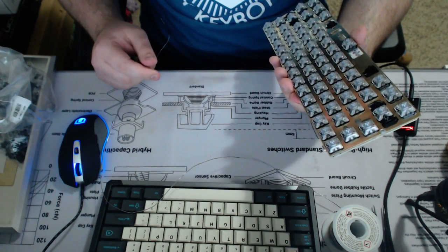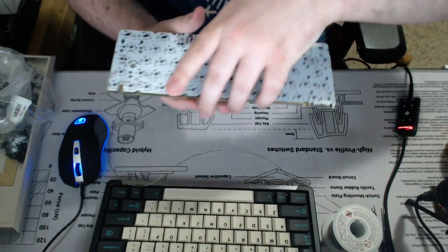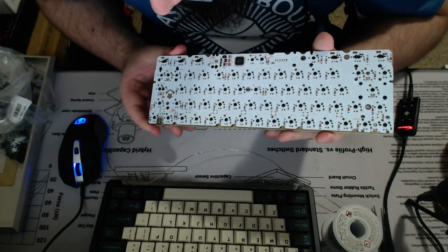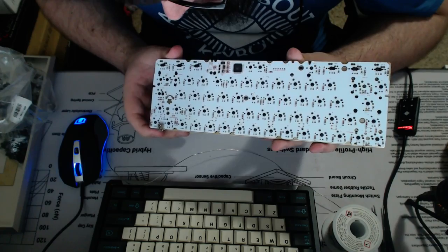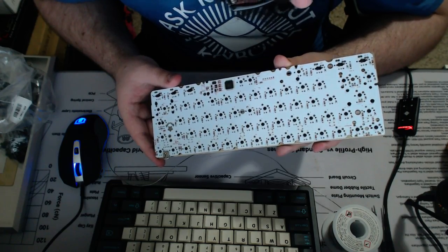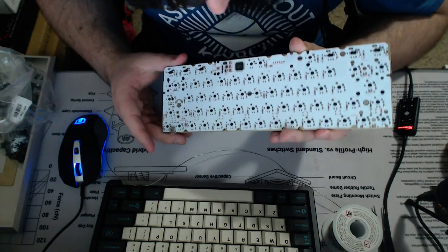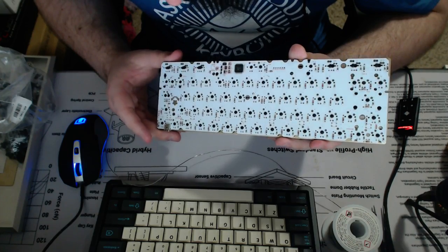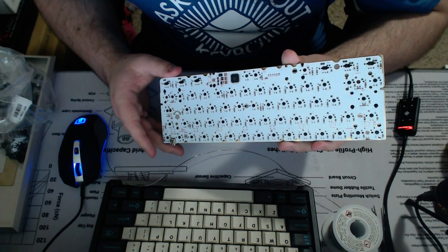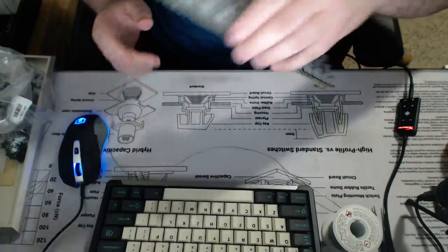I do have all of these switches in. Okay. I'm going to double check, make sure all the pins are actually poking through the pads like they should be before I start. Sometimes if the pin is even bent a little bit and you press it in, it can bend it even more and not actually protrude through the hole. So I like to double check this before I start soldering. Thankfully the pins on these ones all seem to be pretty good. Alright, looks good.